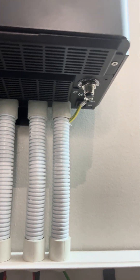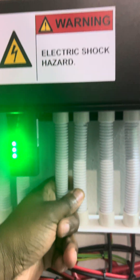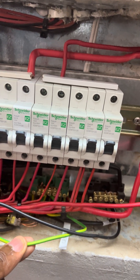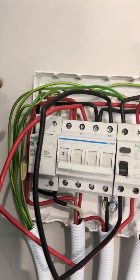Those who are familiar with the Lux Power will know exactly what is what. We've got these two ports that are empty, and this one as well — that's for the generator. These two are going to be connecting our solar PV. One thing I'd like to mention: the standards allow bonding the earth or ground wire. I've got one ground coming from here, going all the way to our new DB, and from there I've split it — one going to our SPD, one to the switch I installed, one to the battery, and then the other one to the inverter itself to ground the inverter.